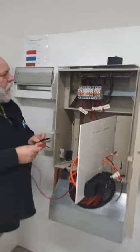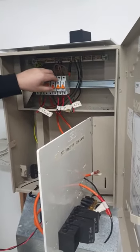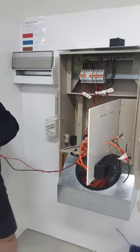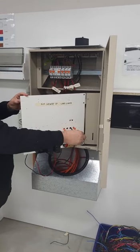So what I'm going to do now is test to make sure the insulation resistance is okay. I'm going to make sure that all my switches are turned on — all your light switches are turned on. Make sure you have things like Edison Globes removed and all that stuff because you'll get a short. We also need to put in a wire from here to here for your link.